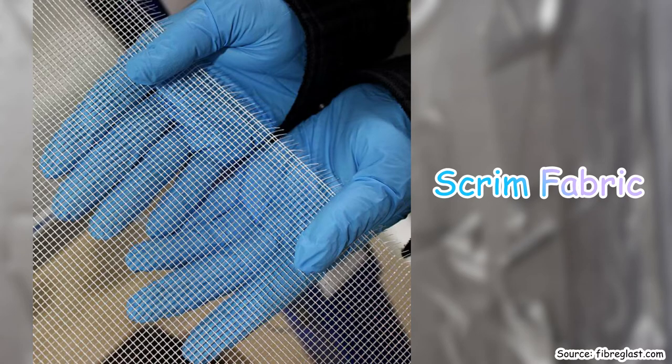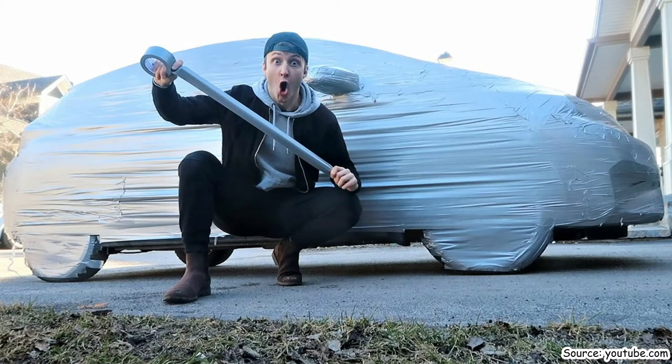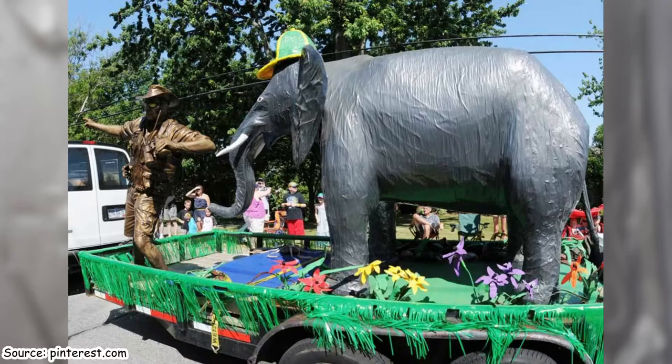It's made from cotton, and it's a key part of the tape. The cloth is what gives the tape its strength, as the threads make a crisscross pattern. Sometimes if you rip it real slow, you can see there are little tiny squares, all crisscrossed. It makes it easy to hand tear, and it keeps the tape stuck to the surface once it's laid down. It's like extra Velcro grip. Finally, once the backing is ready, all the materials are melded together and they become one. Once the layers are combined, the strength of the cloth and the plastic-like nature of the backing combine to give the tape the strength and durability that we all know and love.